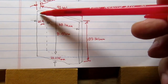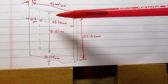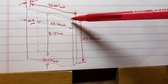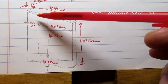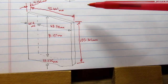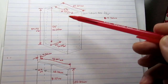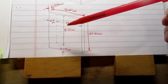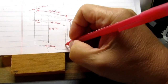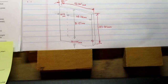And then the other element of this is going to be this flange plate, really. It's the plate which forms the flange along two sides. So I've translated the dimensions from this block to this flange plate, so it's going to sit aligned at the upper right hand corner. Here's the dashed line showing where the back of this will be up against this, leaving this 1-inch flange here and this 7/8-inch flange there. So really, I'm only forming three elements. The outer dimension block for the outside, the inner dimension block in negative space, and then this flange plate. So three simple geometric objects. And I should be able to align this point right here, which I'm going to mark with a circle, with this point here. And I can just stick them together.